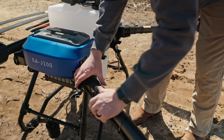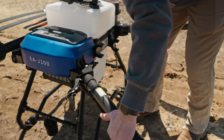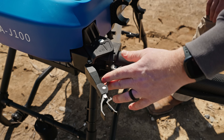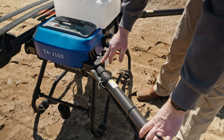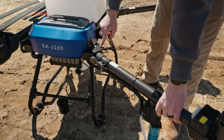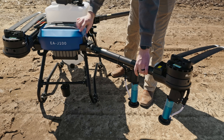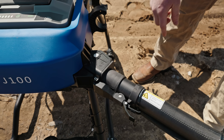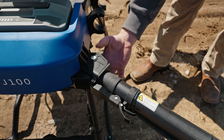If it feels loose and you don't get that cam-over, then you can actually tighten up your turnbuckle — one way is loosen, one way is tighten. Give it a few turns and see if it feels better. These feel tight. Next, we're going to check our connection right here. Make sure that we don't have a lot of play where the arm actually mounts to the frame of the drone. If you see that crack get wider and shorter whenever you lift up on the arm, then you might have to tighten up this bolt. There's a nut on the bottom and you can tighten that up.